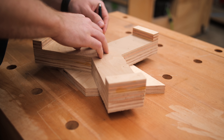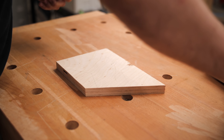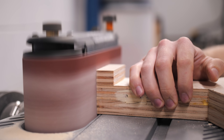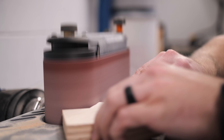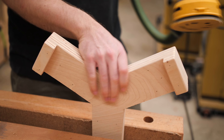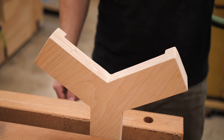I made sure not to add any nails toward the center of the base since I'd need to drill holes there later, so I added a clamp there for good measure. After the base dried, I traced the shape of the center portion onto a small scrap and cut it out — this piece serves as the top of the lamp, connecting the three LED lights and giving them more stability. With all the pieces cut I started shaping them. I removed the bulk of extra material on the oscillating belt sander, which is incredibly useful for getting really nice straight edges. I also checked the ends of the base for square along the way. I then continued refining with the random orbit sander, broke all the edges, and rounded the corners. Finally I applied a few coats of white spray paint and let it dry overnight.